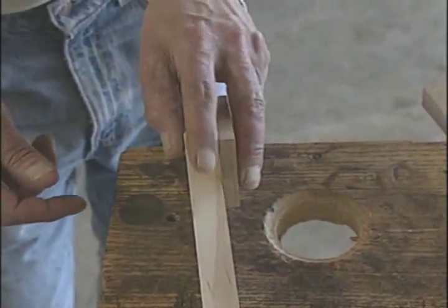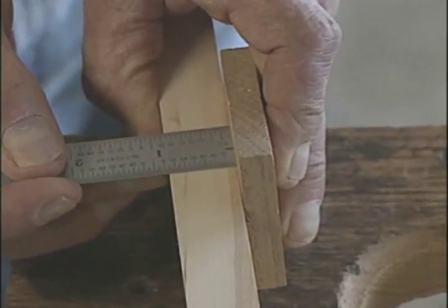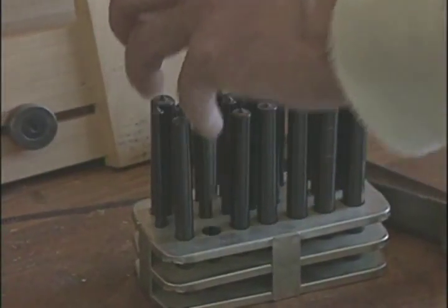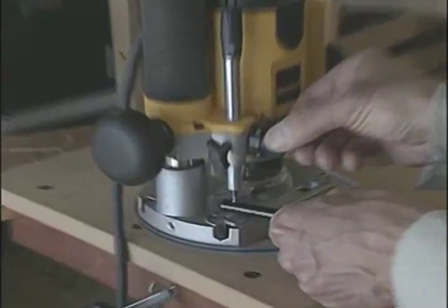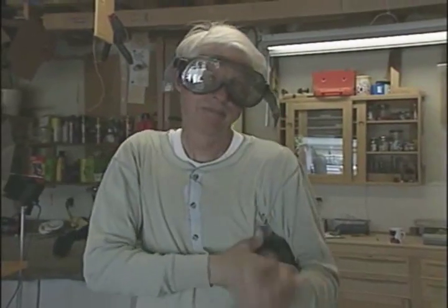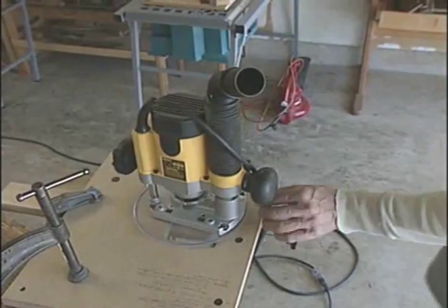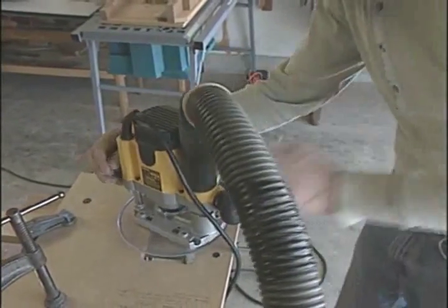If you're lapping sticks of equal thickness, you want to measure and calculate the half thickness. A shortcut I like to use is a transfer punch with a diameter equal to the half thickness to set the final depth of cut on the plunger. I scrapped the depth turret on this tool to facilitate this kind of adjustment. This is a dirty job. Half the thickness of the stick is going to be turned into dust. A vacuum attachment will keep the chips out of my face anyway.